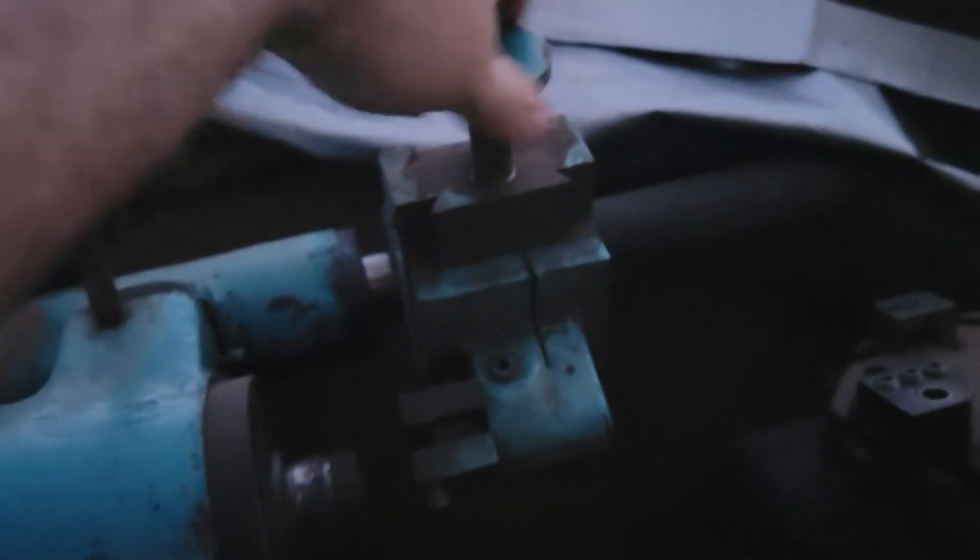So what you do have to do is: after it comes back to the beginning and before you push it back down, give this an adjustment to go down a bit and take a bigger bite — cut deeper in the thread — and then push it down and let it ride.